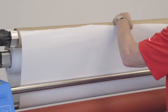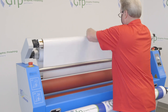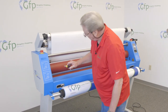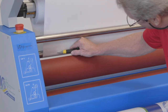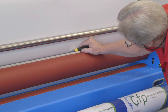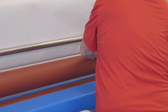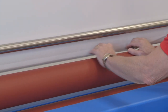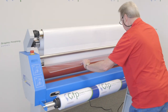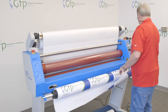I'll attach it to that cardboard tube, bring this up, and attach the film. I'll line that up to the tube and do a little bit of a wrap on there. Then I'm going to take my knife and very carefully score the film against this idler bar. I don't want to cut my release liner because then I'll have to start all over again, so I'm just very carefully cutting that film. I'll bring this over the top of the roller and let it rest just like that.